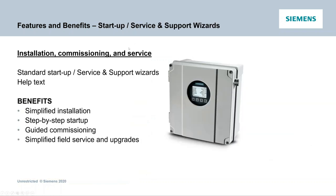The startup and service and support wizards are standard across all technologies. If you've programmed the Coriolis flow meter but never programmed our clamp-on ultrasonic flow meter, it's the same menu structure — making it easier. It provides standard startup and support wizards that simplify installation, giving step-by-step guidance through commissioning. Also, if you're on the phone with a field technician needing support, there are wizards that guide you to gather the information required — so you're not going through menu structures piece by piece. Very easy to install in the field, and when support is required, wizards make that easy as well.